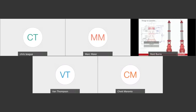And the main reason why we focus so heavily on how level the track is, is because everything that rides on top of the track is affected by that proportionally. And so here's what I mean. Take a look at the two gantry legs on the right hand of the screen. Leg one is supported by a level track, and it's extended roughly 22 feet, and it's nice and plumb. It's very important to monitor the gantry legs to ensure that they remain plumb. Now leg two may look similar to one, and if you're far enough away, it may look like it's plumb, but that can be deceiving. Again, it's important, put a 4-foot level on there.